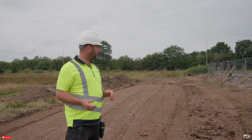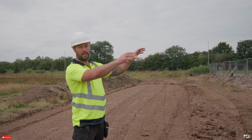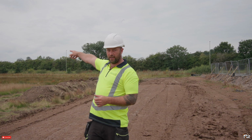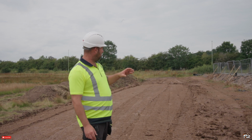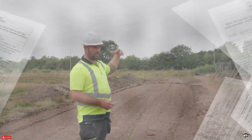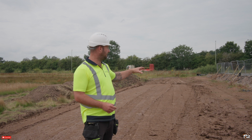We've got them now, and at the far end there's a ditch which is the swale which takes all the surface water from everything that side down there into an attenuation pond in the very corner, and then basically buggers off over the road and down through the town and away it goes. So we had to get numerous applications passed, not just from a planning perspective for the road, but then you have to go through these section agreements with the council as well to connect to a main highway, so we've got all the paperwork for that.